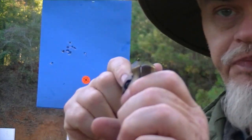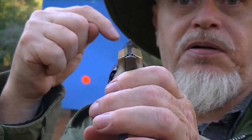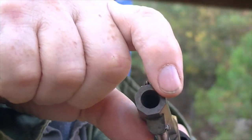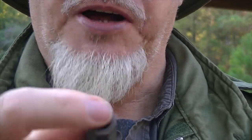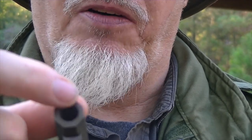I'm going to utilize that gas pressure exploding — try to put a little English on the ball and make it go down and to the right just a little bit. Since with the sights lined up it's throwing up and left, that tells me this top flat right here is where I want that gas pressure to come out. I have put a T-square on this and this lower part is actually a couple of ten-thousandths shorter than this side, so the gas is blowing out on this side and blowing it uphill. So I'm going to counteract that — start from top dead center and go across and down so this top barrel flat and this side barrel flat, I'm going to dry-file a couple strokes.